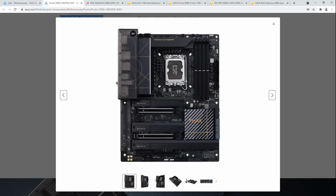They even have blank space down there. What I don't get is this obsession motherboard vendors have on the high-end boards with putting OLED screens and stuff in their rear I/O. Why don't you just, since you have all this plastic over here, integrate a postcode into it? Just integrate a postcode into that and have a little header on the motherboard that it plugs into.